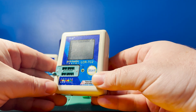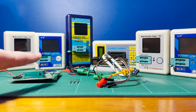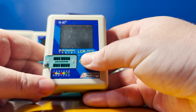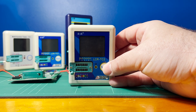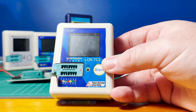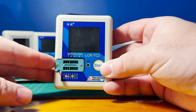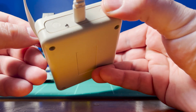So let's look at the LCR-TC2, and as you likely have already guessed, it's a newer version of the TC1. You might be wondering why I've got four of these sitting here, and that's because despite their similar appearances, these two on the left are essentially counterfeits of what is already a very cheap product coming out of China — more on that later. These can measure capacitance, resistance, and inductance among other things, and they can automatically recognize components and even distinguish between different types of transistors such as NPN and PNP. You can see it has an LCD display, and the overall interface is very straightforward with a single button to operate the device. It has a micro USB port for charging the internal 3.7 volt battery, and a charging status LED.